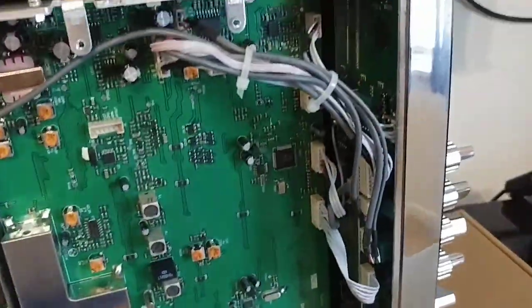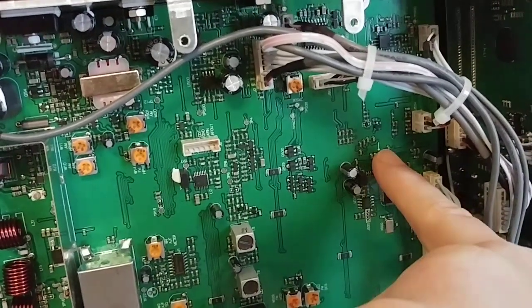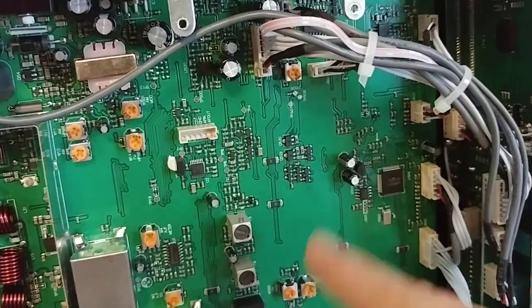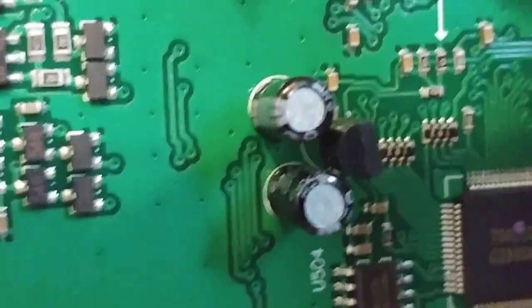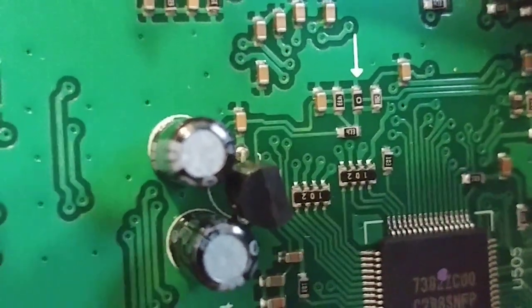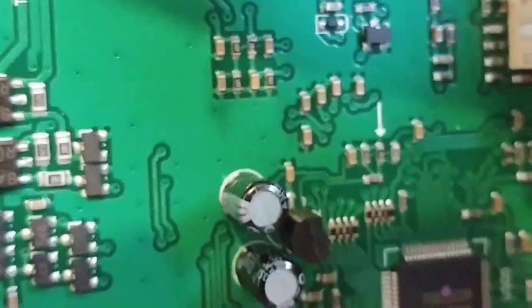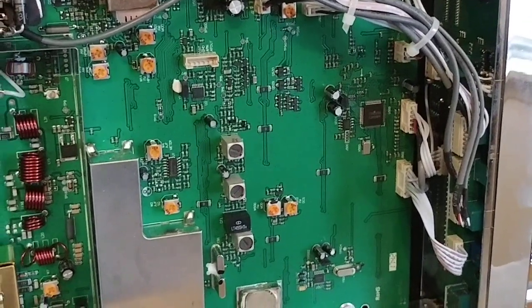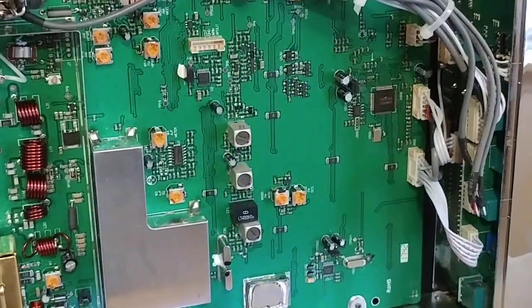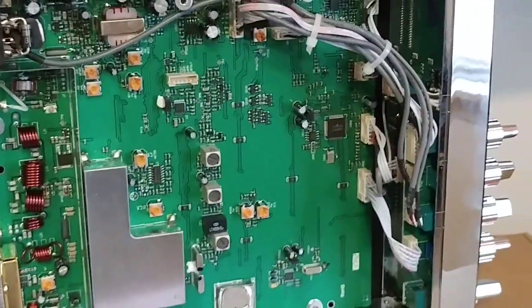Let me get a better look here. See, here's one of your processors, so right in this area just open your rig up and look — you will see it has a zero on it right there. That is the resistor that you want to take out for your 11 meter conversion on your Stryker 655. Take your time, clean it up, and put some power to her to be back on the 11 meter band before you know it.